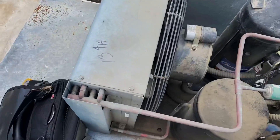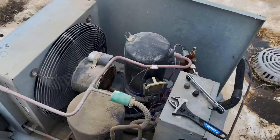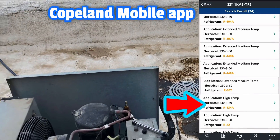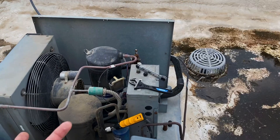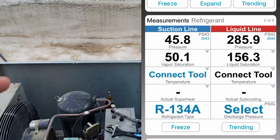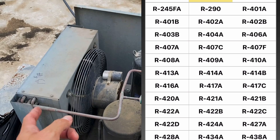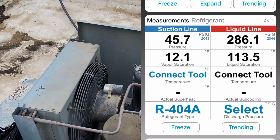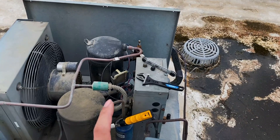On this one it's marked everywhere as R-134a, which when I look up this compressor it uses R-134a for high temp, and for medium temp and extended medium temp it's supposed to be R-404A. So when I hooked up and looked at my pressures, R-134a did not make any sense even though it's marked that. If I switch it over to R-404A, those pressures make much more sense, like it's running fine.